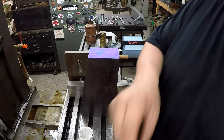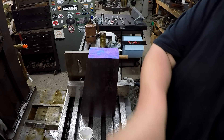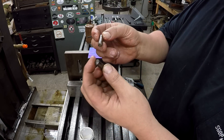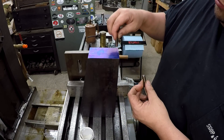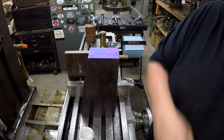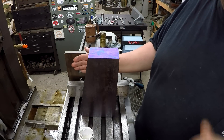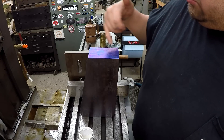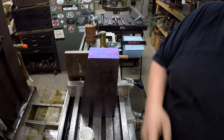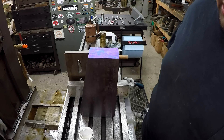I've got everything equally spaced. And then for our three-quarter thick plate here, I've got some three-eighths dowel pins and I'm gonna put two in there like so. I'm gonna use the K&T to drill and ream these right here. I was laying it out because I wanted a visual reference to make sure I'm lining up where I need to be when I do this.